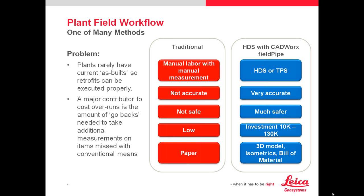We also have a new technology called waveform digitizing — it's kind of a combination of time-of-flight and phase. We get the best of both worlds: the range of time-of-flight and the speed of phase, all wrapped up into one scanner. For larger sites, having the right tool really comes into play. You need to strategically determine which scanner you're going to use and where you're going to use it on those sites.